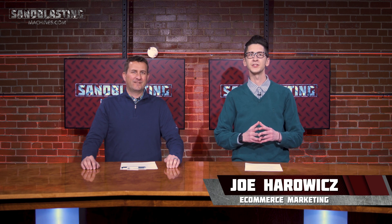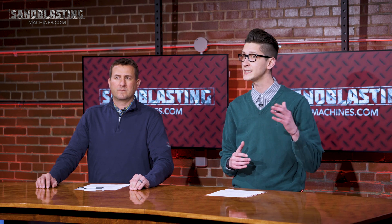Hey, what's going on guys? Joe and John here with sandblastingmachines.com, and today we're going to be talking to you about breathing air systems. If you're going to operate a blast machine or otherwise going to be exposed to abrasive blast media, you are required to wear appropriate safety gear. Besides abrasive resistant clothing, leather gloves, and eye and hearing protection, you also need a NIOSH approved Type-C-E supplied air respirator. Let's go right into the breathing air respirators.